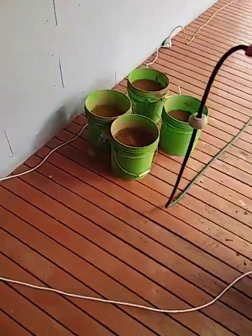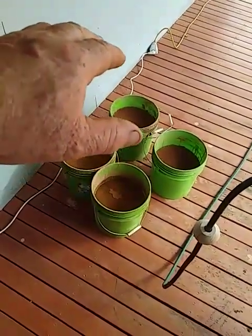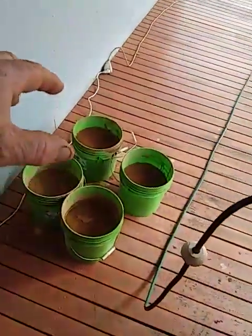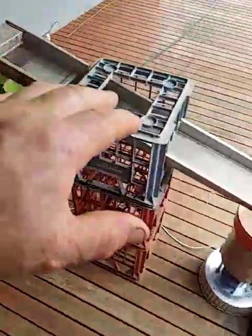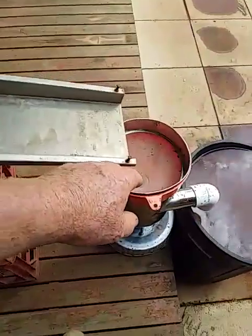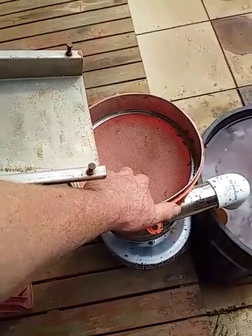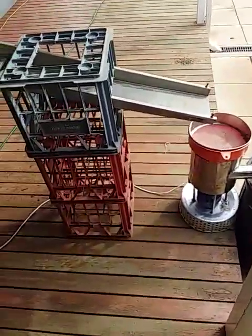What we're going to do now is put some of this dirt through. This is clay material, and to break it up we've put some detergent in it so the clay doesn't become lumpy and stick to the concentrator. We'll set up the solution here and run the dirt in at the top, then it runs down into the machine. It has a classifier which tells you the size of material going in, so you're not flooding it with oversized material.